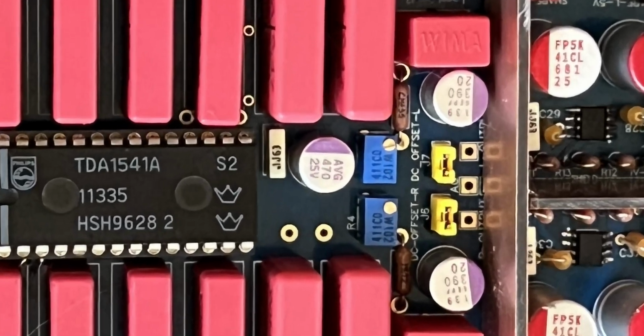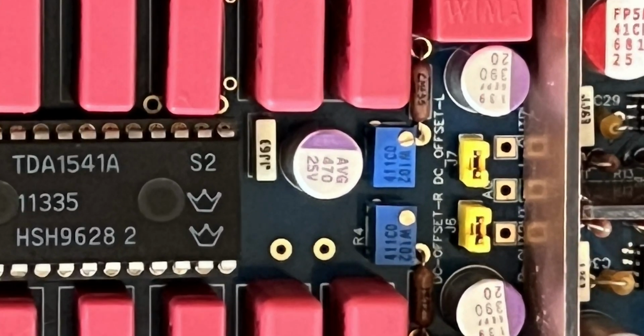And for those of you who are really advanced, start with that first, but down the road, if you want to split the power, have separate power to the output stage than the DAC chip, you can also do that. The board lets you do that, just a matter of changing a jumper pin here and there. There's also a special adjustment to adjust the DC offset compensation, and you can adjust it to zero and this way you don't have to use any capacitors. But if you prefer not to use that, the option is there. You can not use that and use capacitors. It is up to you.